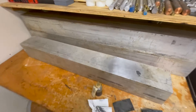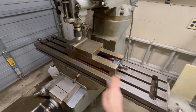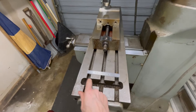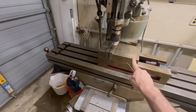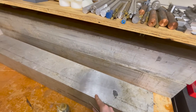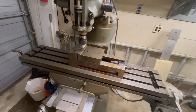What I'm going to do is cut this to the length needed, which is about 25 inches, and then take it over to the Bridgeport — put it on the table without the vise. I'll have to figure out a way to fixture it because it's six inches wide, which is the width of this ruler, so it's going to cover up the T-slots. I'll only be able to grab it from the ends, then take the precision cuts needed to make the tracks that the linear ways would screw to and make all the mounting holes. The X travel on this is 27 inches, which is longer than I need for both the column and the base.